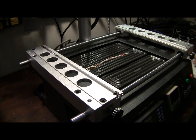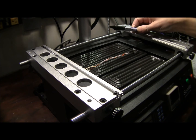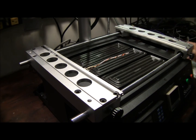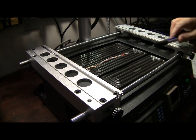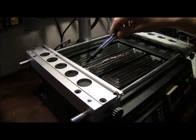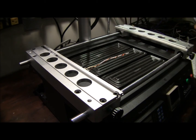Having the probe against the plate is just wrong — it doesn't preheat the board sufficiently and can damage it. Any probe tight against the plates needs to be modified to be more usable. Note that at Spitfire Mods we focus strictly on large-size BGA boards — eight to nine inches or bigger. We're not talking about cell phones or small boards. If you had a small board that barely covered the heat zone, you might actually not want your probe up against the board or may need a different placement.